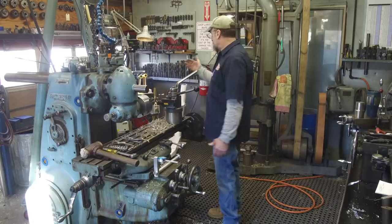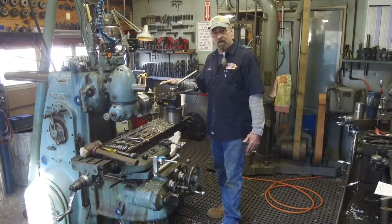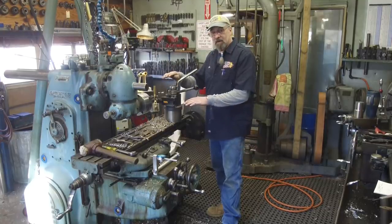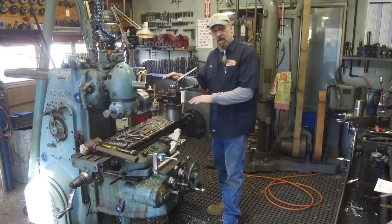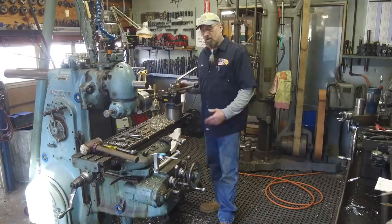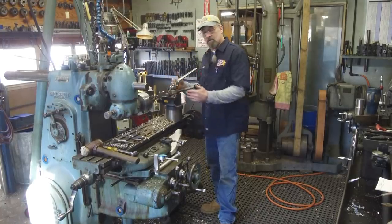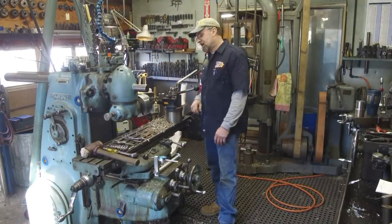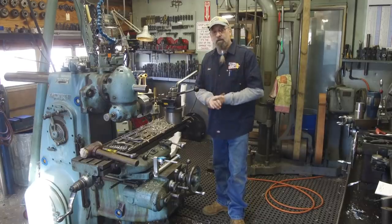It would probably be nice if you had a rotary table to have some kind of a sliding compound in and out on the rotary table. You don't need to have all kinds of different heights in there. Just get the straight flow in and out on a compound, and then you'd be able to easily just crank in your dimensions instead of having to loosen and move and adjust your radius or your arc. Just what's on the mind here.